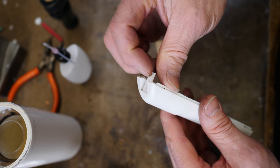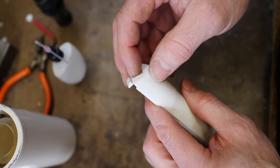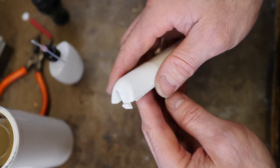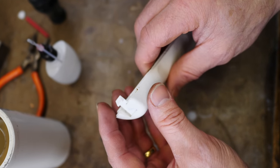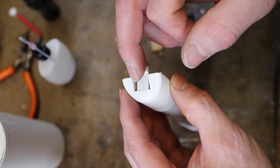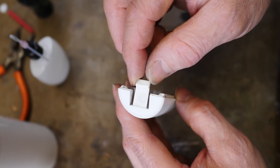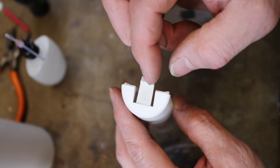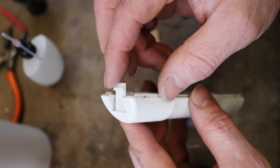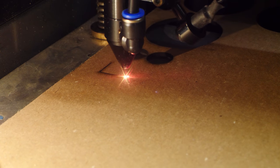With the silicone, there's a pretty big undercut right here. I think the silicone can handle it, but I have to make 10 of these and I'm not 100% sure the silicone won't tear. So we're going to make a little piece here — normally in production this would be a slide, but this is going to be a little removable part. We're going to cast something in silicone to make the parts for this little mold.